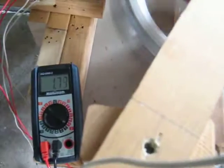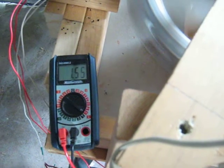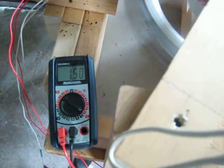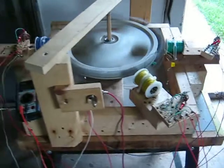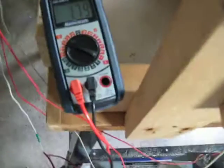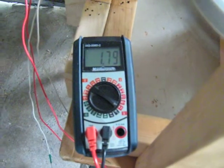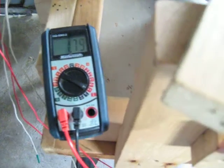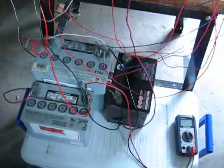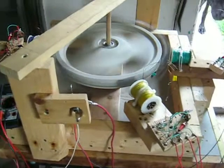And this is encouraging, knowing that when I do put torque on it, it's actually going to want to sustain the torque — because it's a motor, but it consumes less energy. And that's current. Really, really cool. I wanted to share that with everyone. That's what I'm going to be working on — making lots more coils, getting lots and lots of torque. If I get six coils on this thing, I can estimate this times two — so three, three and a half amps I'll be pulling at 24 volts, 23 volts. It's not even a hundred watts. And I should be able to get a hundred watts off of that. We'll see. Keep ya updated.